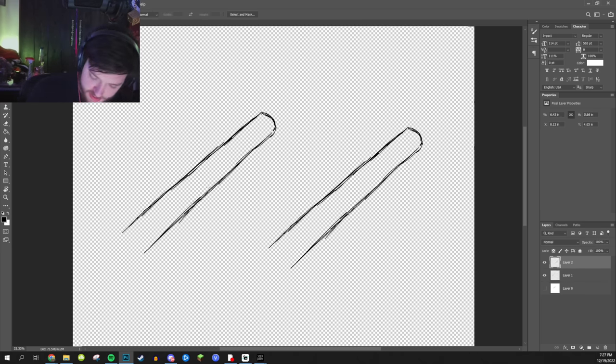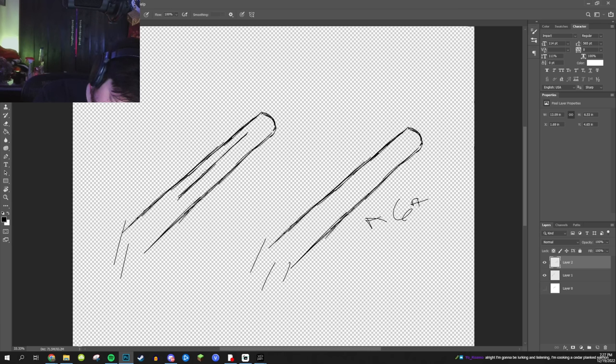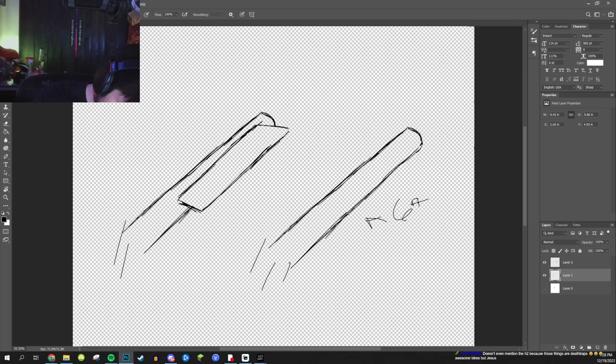I have this idea, so let's say that this is what we're looking at right now, are the frame rails of the build. Let's just say these will be like 6 foot. This is gonna have two long frame rails, and then they're gonna come to an end, obviously. I think I'm gonna attach or make my own adjustable mounts here for the TV, because I'd like the TV to be adjustable forward and backward. So how can I make the TV adjustable forwards and backwards? Probably add some gussets here. I'll probably take my CNC machine, do a long cut channel on this piece of metal. This will just be like a big line that's cut out, right?